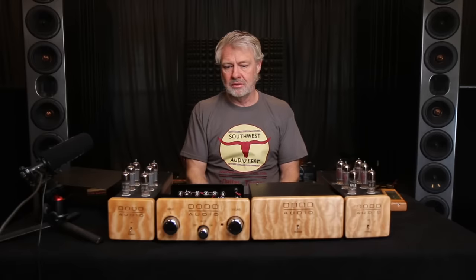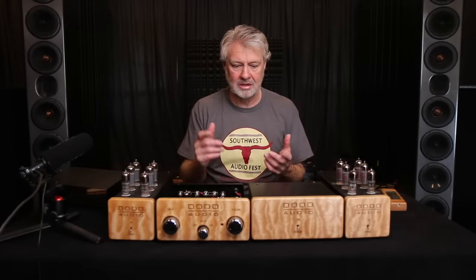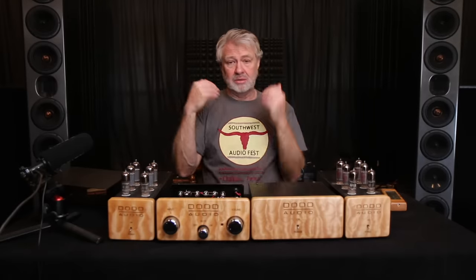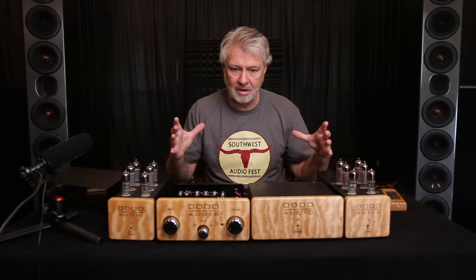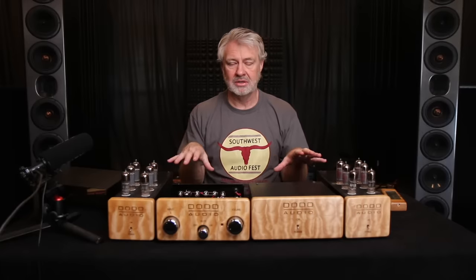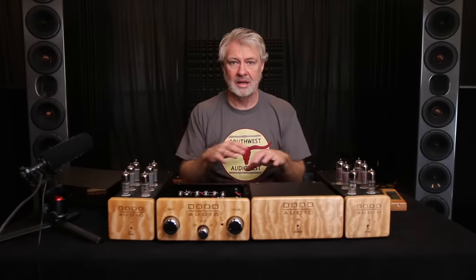Steven Stone at The Absolute Sound said we had the best sound at the show, cost no object — which we thought was great because Gary priced those amps at $3,400 for the pair and you could get the preamp for $1,600 to $1,800 depending on what caps you wanted. We weren't even near cost-no-object territory but we were at that performance level. It was a big deal at shows to have the whole front end off the grid, because we didn't have to deal with the AC noise at hotels, which was horrendous. Sometimes we'd get a system sounding perfect at home, then set it up at a show and think, 'that doesn't sound the same here.' Even with room treatment, the AC noise was a whole different issue, and we'd have to start playing with power cables, balanced power supplies, and Uber buses to try to get the noise level down.